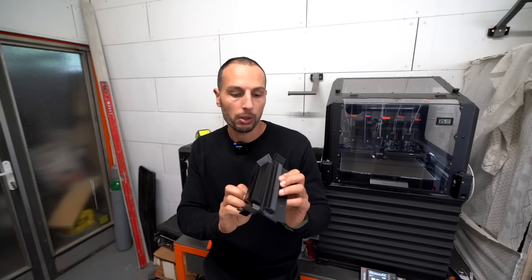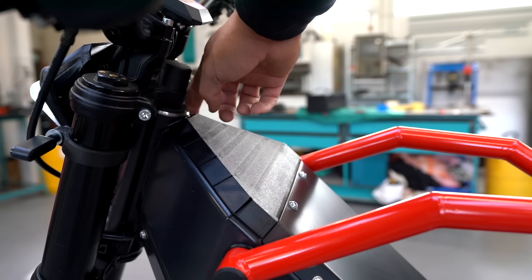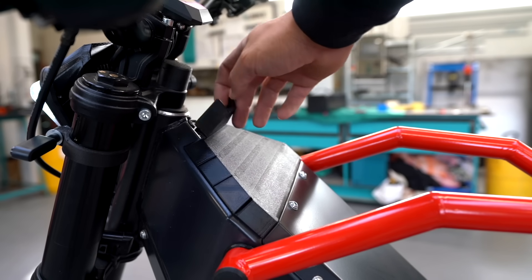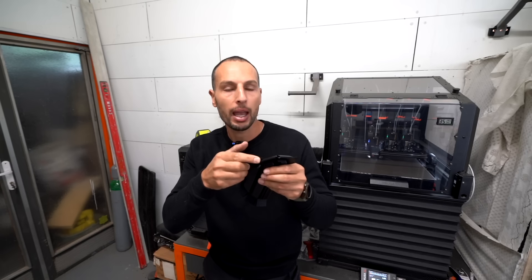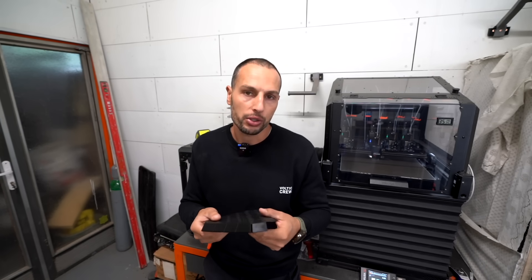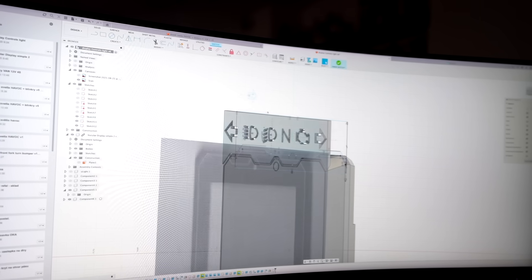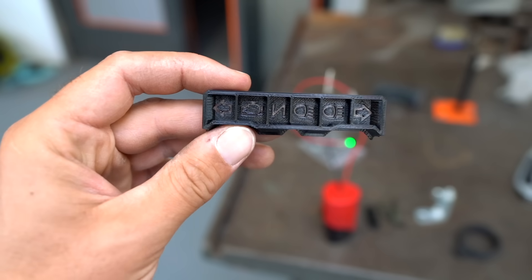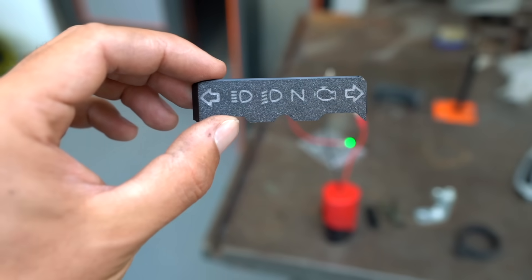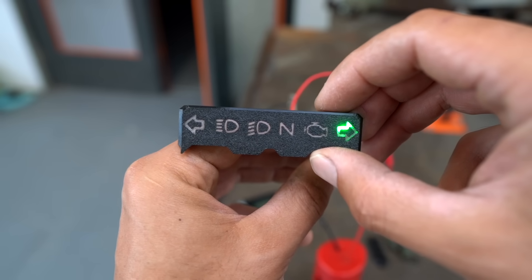It creates this awesome 3D printed door with flexible hinges — you can just open it, get the charging cord out, close it magnetically. No locking, no handles, none of that is needed. The improvement since the first version is that we now have these little overlapping gaps on each layer which adds extra protection, sealing the access to the frame against water even more. This is also a neat use of a dual-head 3D printer — we can combine different filaments: one transparent for icons and the other for the body itself. Pavel models separators for these icons so there is no light spill to the other icon.